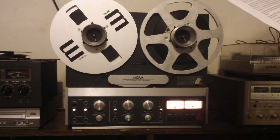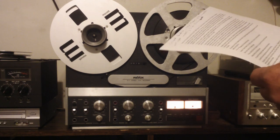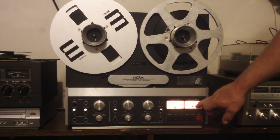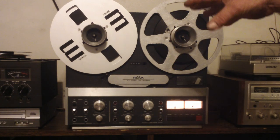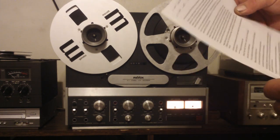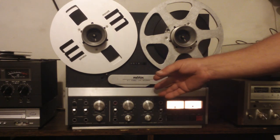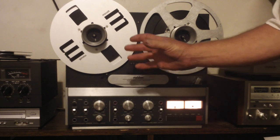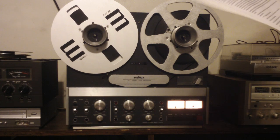Like I said there's a ton of work been done on this thing. All the trimmers have been replaced. The peak LEDs are operational — that board gave me fits, so the trimmers are of an older variety but they're a good trimmer, not the ones that are going to fall apart. The record relays on the board have been replaced and Erhard Audio sells a nice drop-in for that, so those are all new.